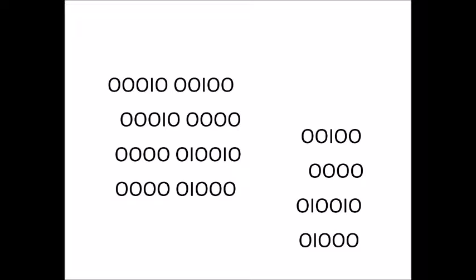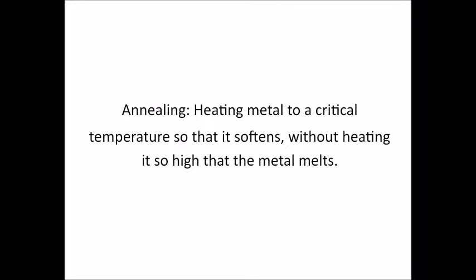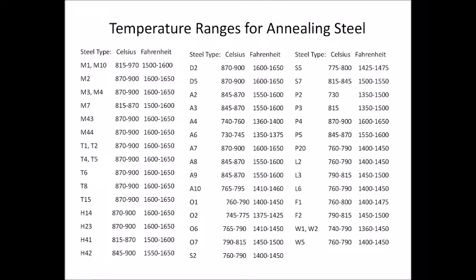But I'd really like my shears, drills, and other metalworking tools to last as long as possible. Annealing is heating the metal to a critical temperature, but not so high that we actually melt the metal. This helps the molecules in the metal align nicely so that the metal is easier to work with. It can get tricky sometimes because the temperatures we are looking for can be hard to see, especially if you're kind of new to the process. With iron and steel, we have the added fun that the temperatures can really mess with the chemical and crystalline structure. There are actually different names for iron alloys depending on the chemical and crystalline structure and how it's been heated and cooled. The temperature we're looking for depends on the alloy or mixture of metals we're working with, and what we want to do with them.